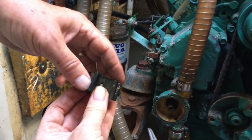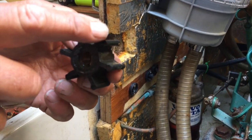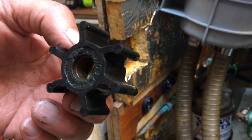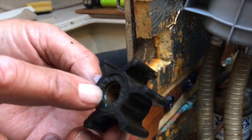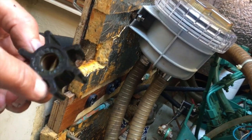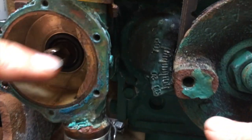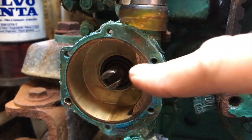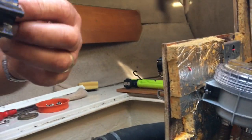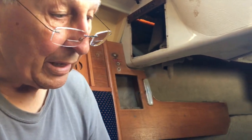So, there you go. What happens is when it's left for a long time, which this has been, the impeller blades take a set, so you can see that. They will still work, but they do take a set. And also you'll notice in there, there's a pin. Can you see that little pin that goes up and down? You can knock that out, you can push them out. But if you look on there, there's a little slot, and the pin fits into that slot. And it's that that turns it around so that it rests against that pin and turns the impeller,